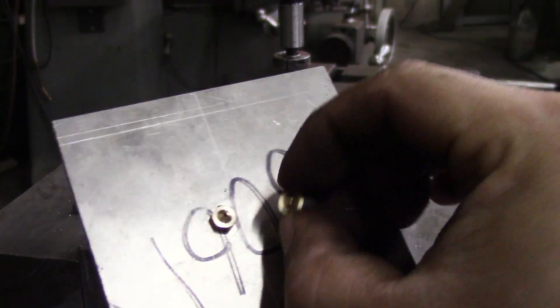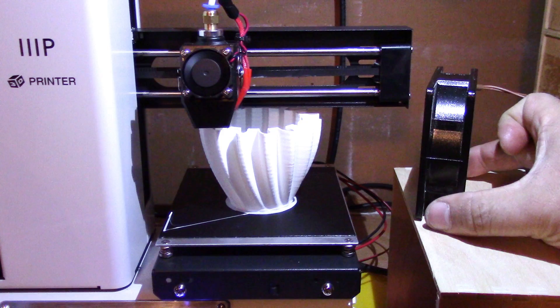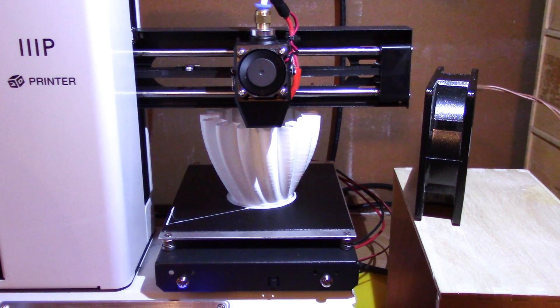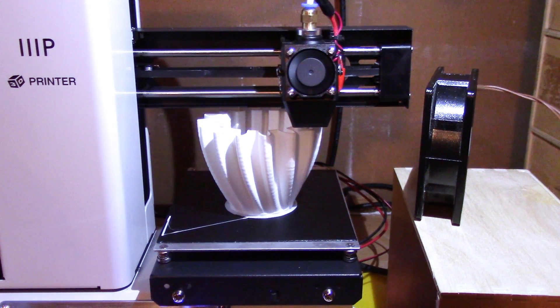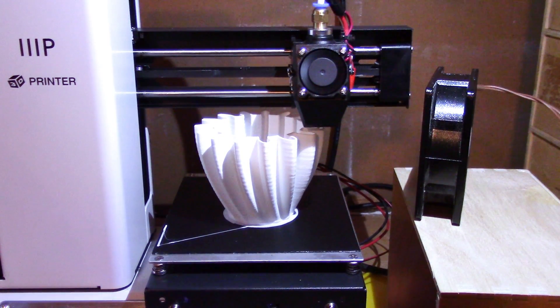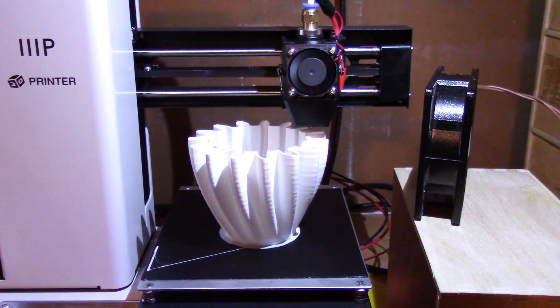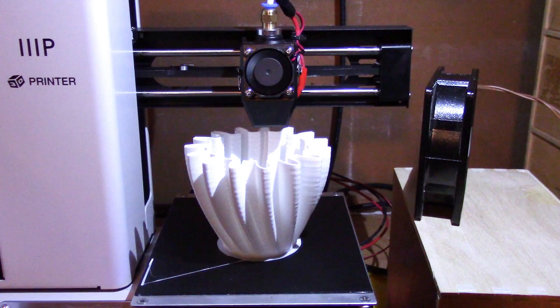Let's take a look at the before and after. I'm not sure if the camera can capture it. And here we have one of the newly modified nozzles in the Monoprice Select Mini. I am very happy with the result. This particular nozzle is the one millimeter in diameter and I'm using a 0.6 layer height, which is why you see coarseness in the print, but it worked perfectly — no problems, no hiccups, no clogging, no issues.